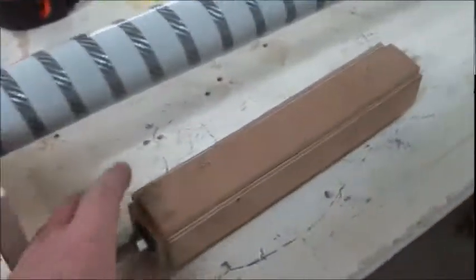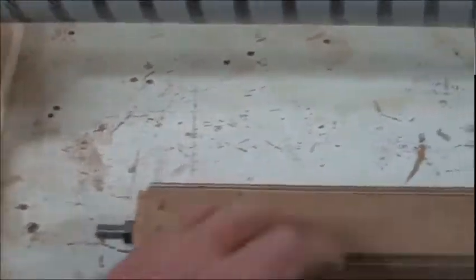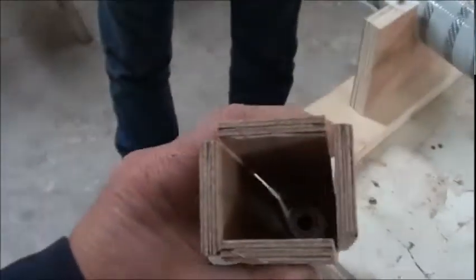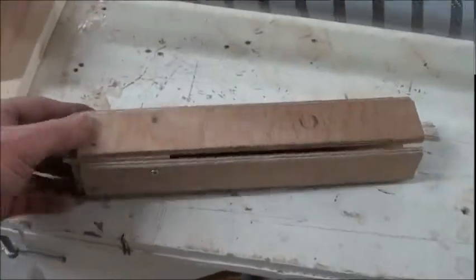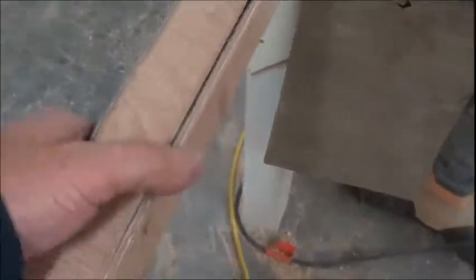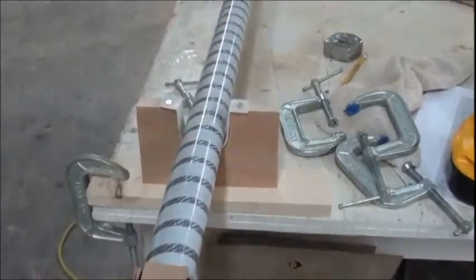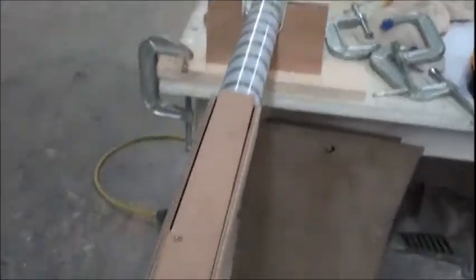What we've made is this little device here. We put a piece of all-thread rod in an inch-and-a-half block, and then we screwed some quarter-inch plywood to it, and that slips over the end here. We clamp it, and then we made these yokes with a little plastic in here, and we spin the mast and sand it.